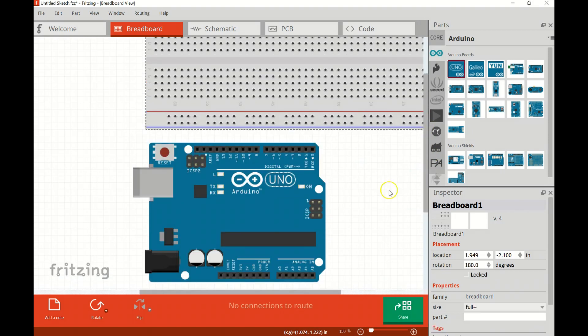So we're going to make use of our digital outputs. Remember from the previous video — the onboard LED is tied in parallel with pin 13. So when we call on pin 13 to go high, that onboard LED will turn on as well, but we're going to have an external LED turn on at the same time.